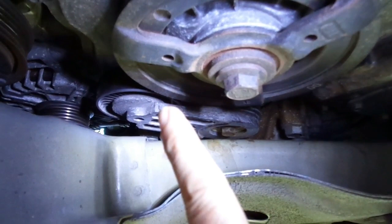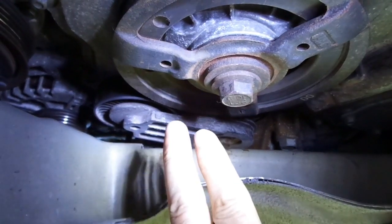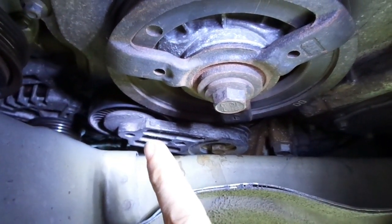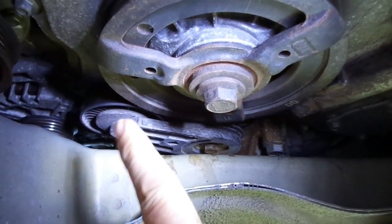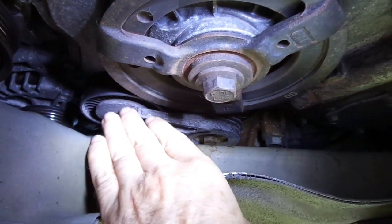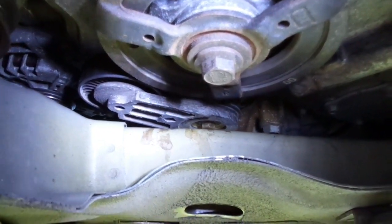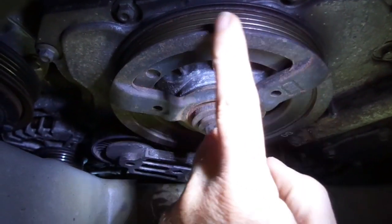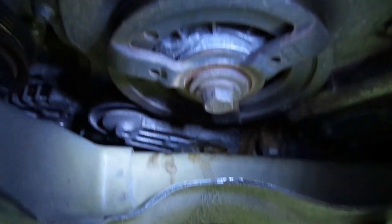For your viewers, right now you can kind of see there's a square hole there where you put the right kind of breaker bar in, but there's nothing that can fit in there with the clearance. So what we're going to do is make this idler pulley go up. By just pressing on it with a screwdriver, I can actually force it to go up. So we're going to get some other piece of tool and just jam it right up against there and push up on it to relieve the tension. Then Bob can get it around the idler pulley here and we'll leave it off of this bottom pulley so I can take the pressure off and he'll be able to slip it over — hopefully.